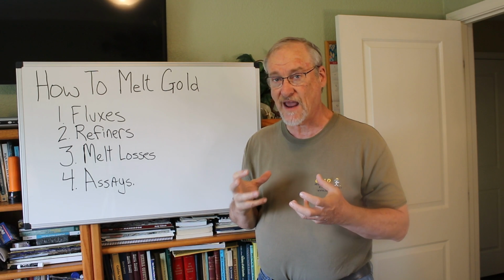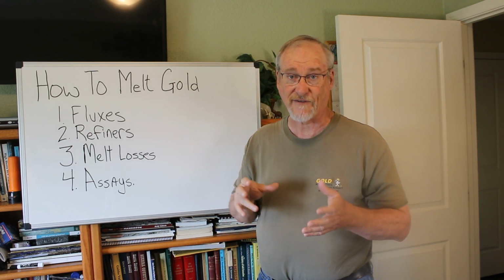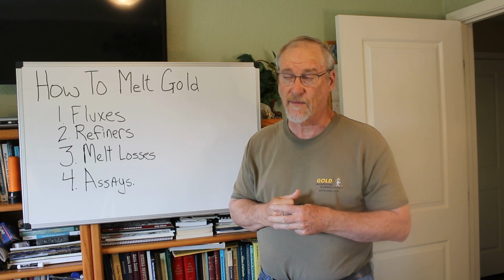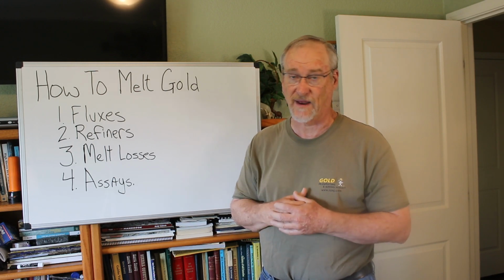I don't recommend those. What I'll tell you is that the maximum temperature you can reach with those kinds of electrical heating element units, which have a graphite crucible that goes in them, is just about what it takes to melt gold. You can melt gold in them, but if you get much hotter than the melting point of the gold, you can actually wreck the heating element. So I don't recommend those.